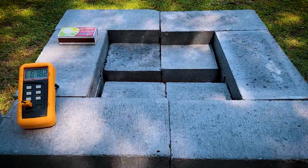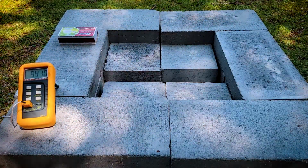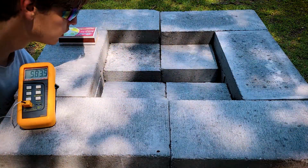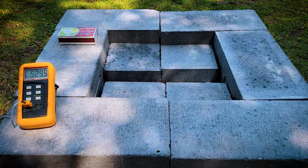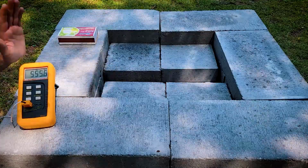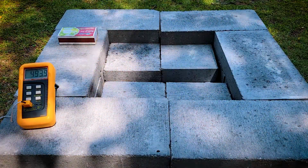But moving on from that, actually getting the temperature down to 250 was really quite difficult. I kept pulling gas out and, you know, incrementally got lower and lower temperatures, but at about 400-ish degrees, I couldn't pull any more gas out because the flames would just die. So I eventually settled on getting it as low as I could and then adjusting the mixture to actually be less efficient in order to drive the temperature down even further.